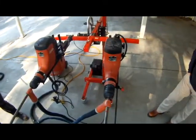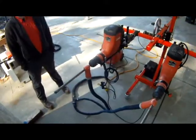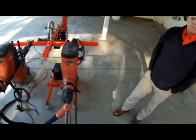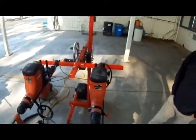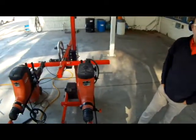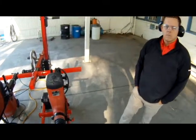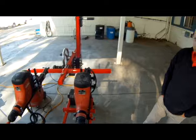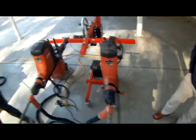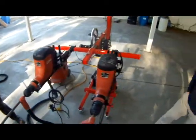Even if there's a slight off, when you're drilling and one of these finishes first, you just keep drilling. And the one bit essentially will go dead as this thing keeps it from working any further while this one finds home. So your holes always get the same depth no matter what. There's enough flex in the system to let any speed difference be accounted for.